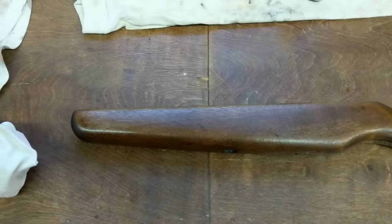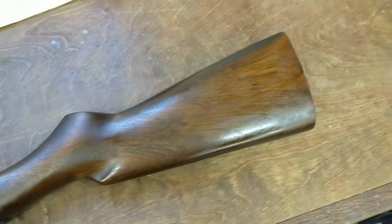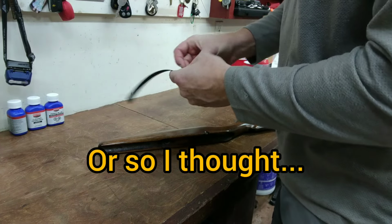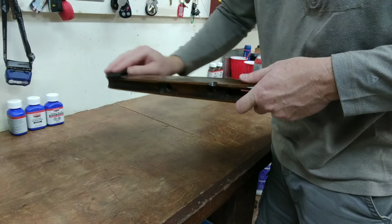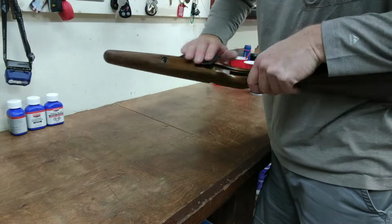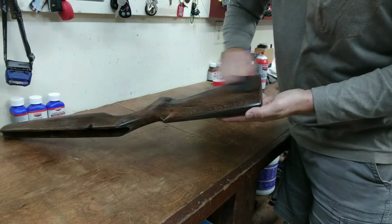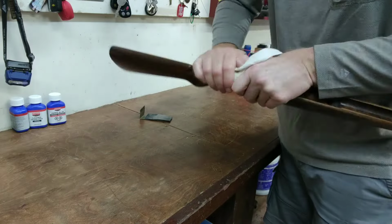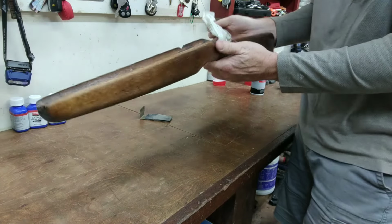After the second coat, here's the product. Some mismatched glossiness in there. I'll knock it down with double-aught steel wool, and then I'll put a third coat on it. Alright, well, last sanding before the last coat. So some 400 grit sandpaper this time. I never know which grit to use. So we're going to try this real quick, give it a quick scuffing. See how this method turns out.